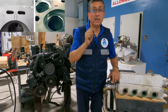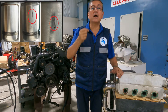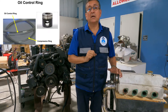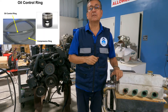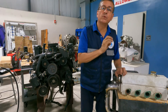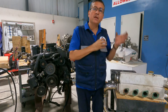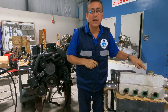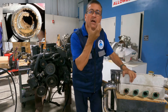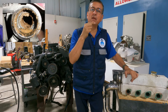Other possibilities include a cracked head, cracked cylinder liners, or piston ring issues — all of these scenarios can produce oil mixed with coolant. On the other hand, if when you remove the cap on the expansion tank or reservoir you see calcium deposits around the cap, this is an indication that salt water is mixed with the coolant.